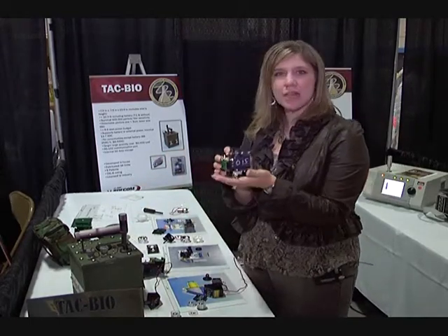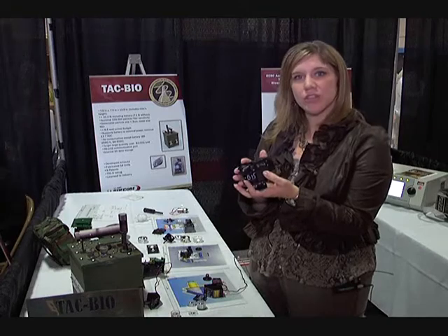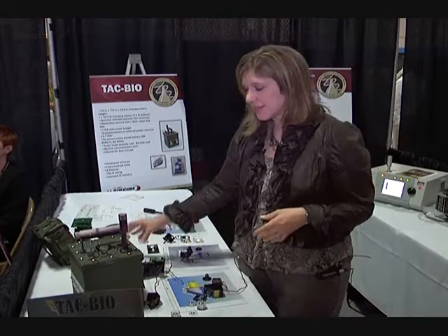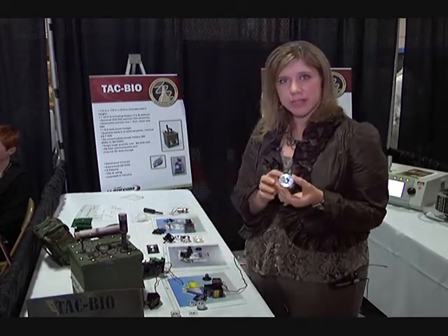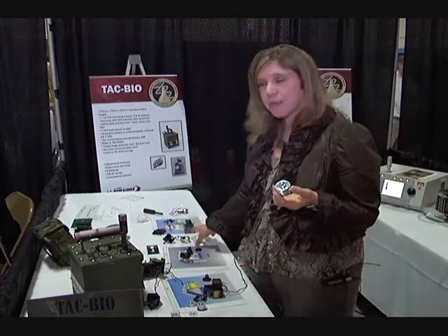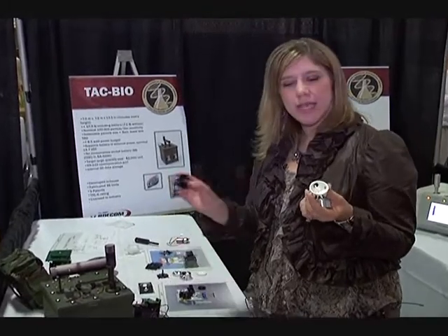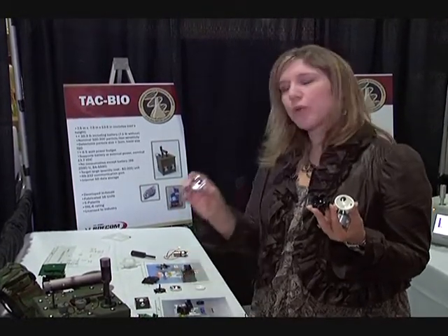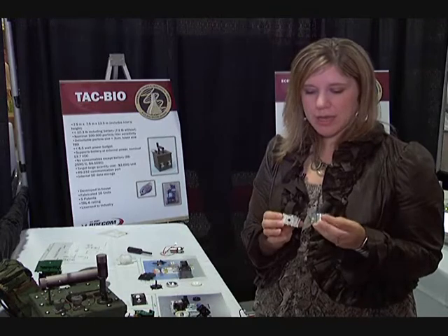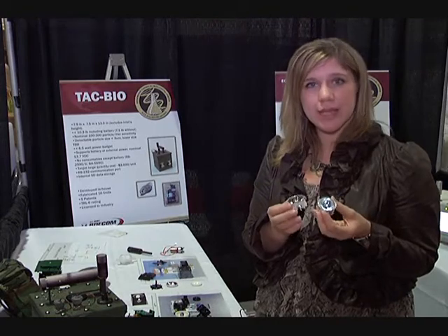This that I'm holding right here is the actual detector — it's full size. It weighs about 1.3 pounds, but we do know how to make this for actually three quarters of a pound, and it will be much, much lighter. One of the main things we did to achieve that is we had diamond machined mirrors for the collection chamber. But our own facility here, ADM in engineering, was able to injection mold mirrors out of Lexan, either white or black, and then get them coated with aluminum. This actually has the same comparable quality as the diamond machined ones, so we were able to get comparable results.